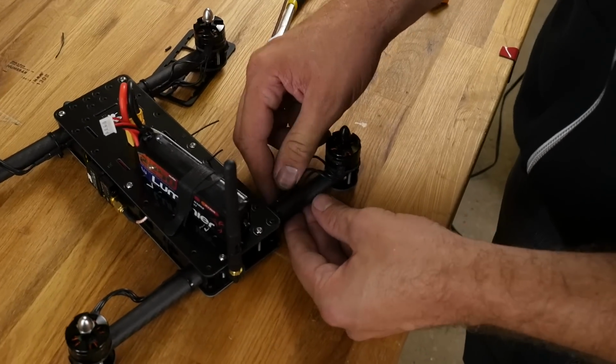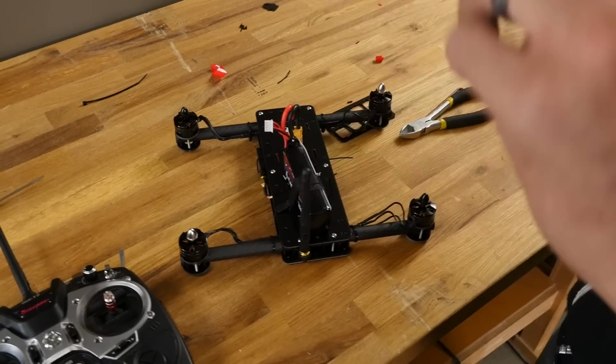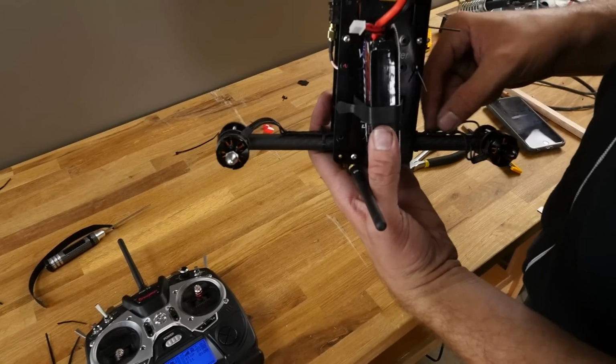The way that works is if you're energizing field A, B, C, A, B, C, and you switch just 2 of them, what happens is you go B, A, C, B, A, C, B, A. It just reverses the way that the thing energizes. So it has to do with patterns.